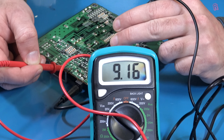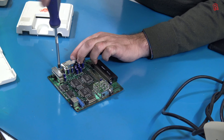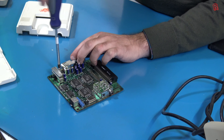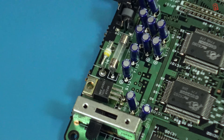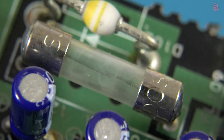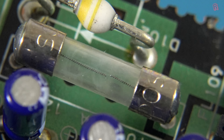Back to our broken console: I continued checking the voltage from the power input, and then something more obvious came to light when I took the heat sink off — hidden away under there is a 1 amp fuse, and it looks a little milky on the outside. Zooming in, you can see the fuse has quite obviously blown.